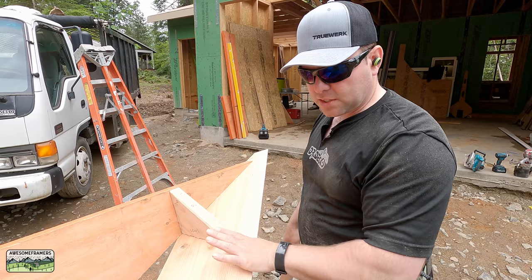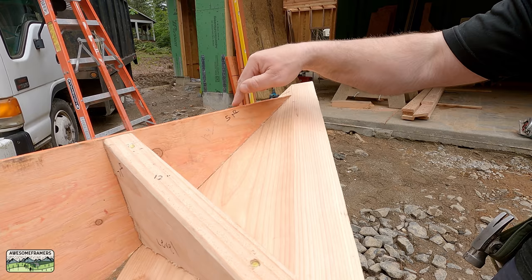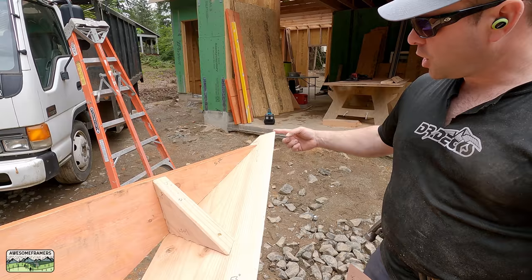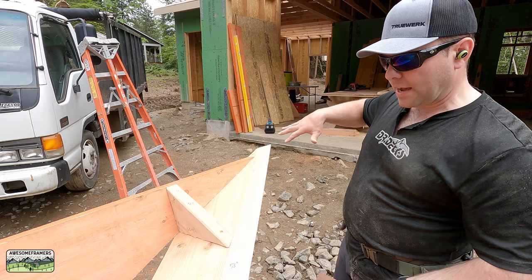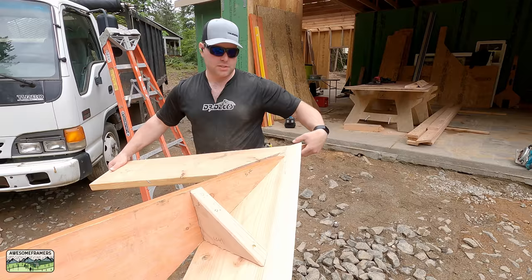It took about three minutes to bevel the sleeper, but here's why it's worth it: we don't have to do any math up here where the ridge lands on the sleeper and the sleeper lands on sheathing. That sharp point is made to the math. We use the other angle for this — the 5/12 sheathing — we cut that, we bevel this, and the other sleeper is going to come right here. Keep in mind we did not center this just so it would hold itself.